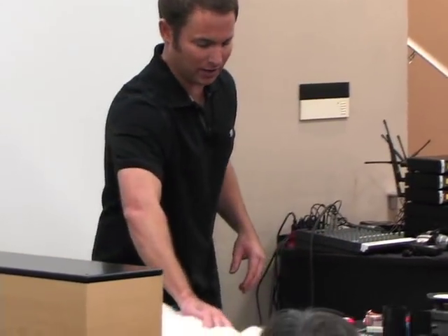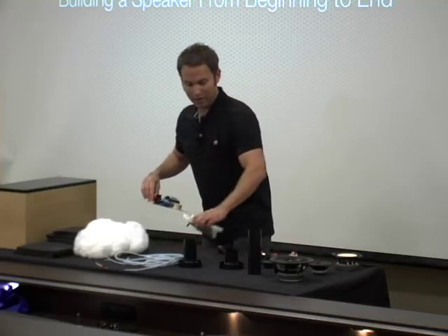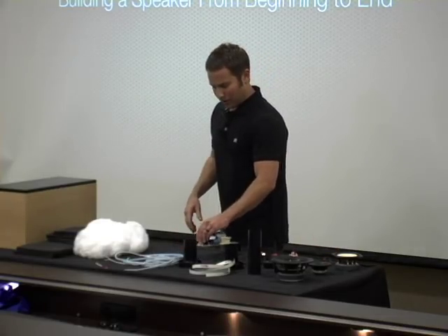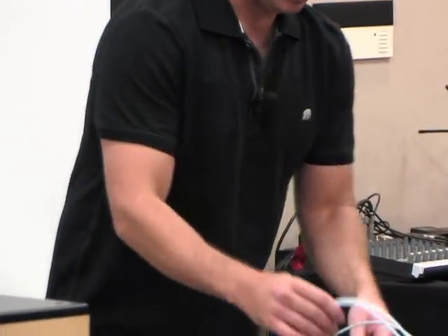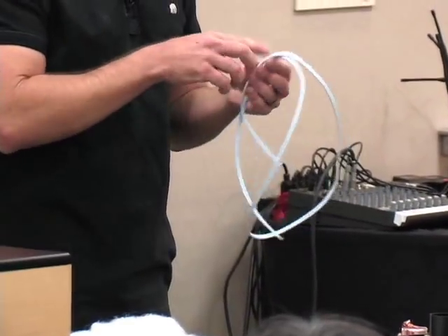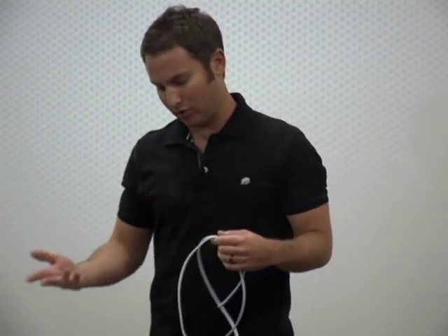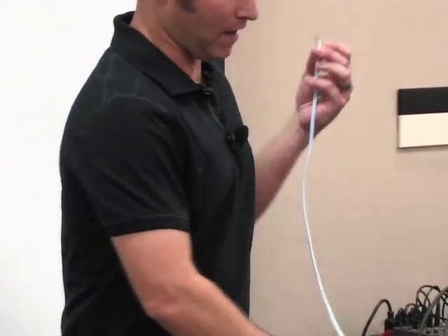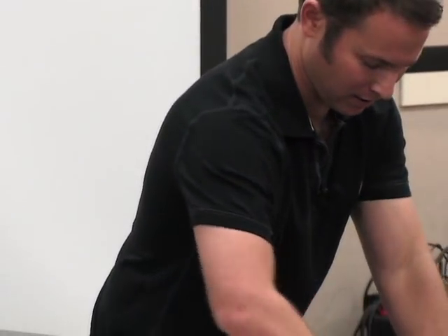This is the crossover. The first step is to assume you've bought this kit and go through putting it together. I've consolidated some steps since a typical build like this takes a couple of hours. You've got the crossover, and you need to connect speaker wire to it — cut to proper lengths, a small piece from input cup to crossover, a bit longer to the mid-bass driver, and a bit longer to the tweeter. You'd strip the ends, then put quick connects — female tabs — crimped on to attach to the circuit board.